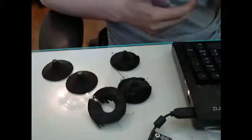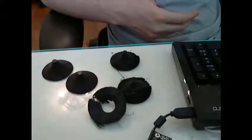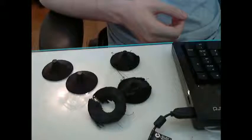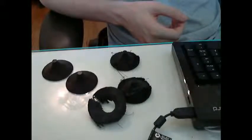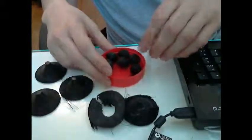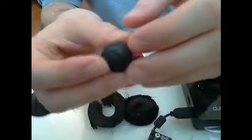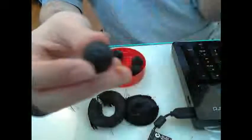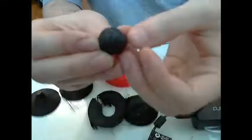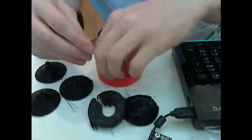Those were the main settings I was messing with. The default of 0.25 was just really bad — I'd suggest changing it automatically. I printed a lot of balls trying to get the other part to work, and most came out similarly. The main problem was that the first two layers were sticking way too tightly. I had to cut them off with an X-Acto knife on pretty much all of them. There was only one print I was actually able to peel off.